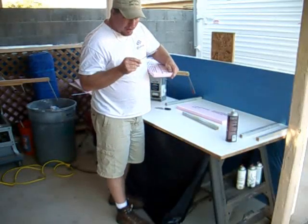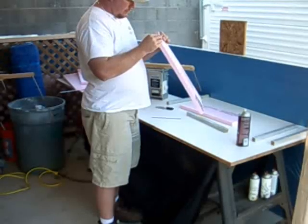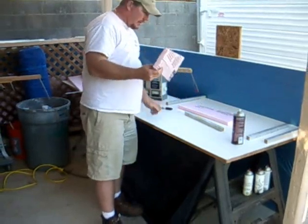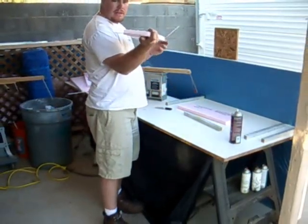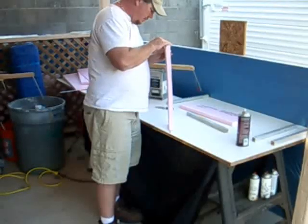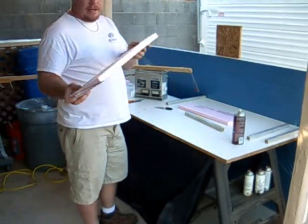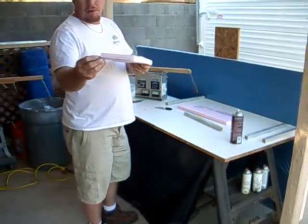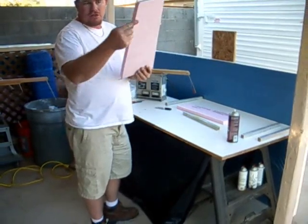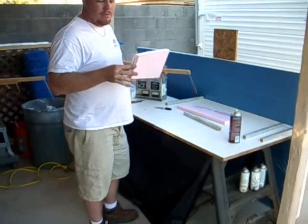Normally what I do is I made marks on my template and I'll come up a quarter inch from the bottom. You can take a pin before you do this process and go ahead and put your airfoil on the end. That's a positive template and I'm going to put the root on — that's giving me plenty of airfoil that hangs off the end. On the trailing edge if I happen to come off faster, I'll still have somewhere to go with the wire, because you don't want to stop the wire or have it fall off since it will eat the whole bottom edge with the hot wire. I usually keep some direct pressure on it for a little bit and make sure the templates are set.